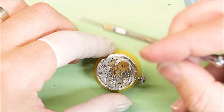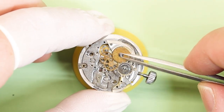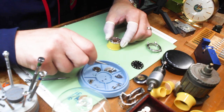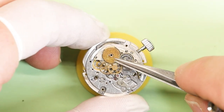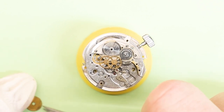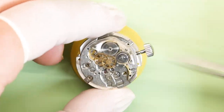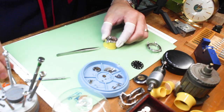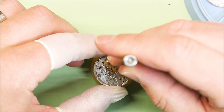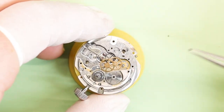I kind of want to get into this watch and not be in it very long — the less time spent, the better. To pull this train completely out, we'll have to take apart the ratchet wheel that's above the mainspring, because that is over the center wheel — the seconds wheel, sorry. And if I was a little better with the tweezers it wouldn't be flying on me. I'm just going to keep this stuff in the video because it lets you guys know that not everyone's perfect. I could clean this up so it'd be a masterpiece, but what's the fun of that?